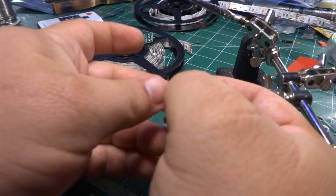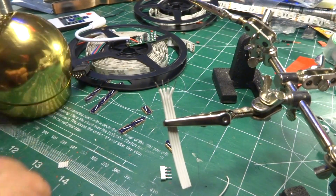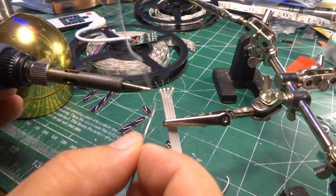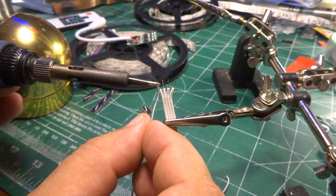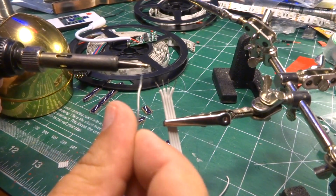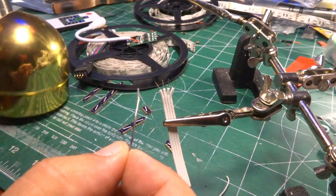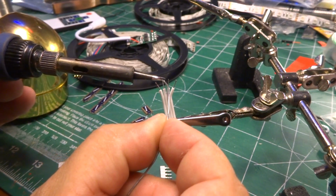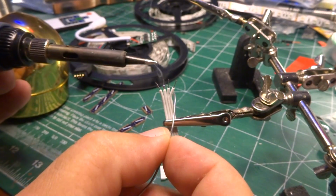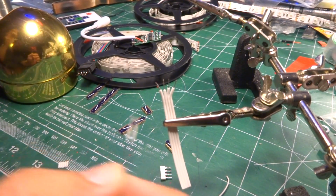So next stage is the tinning. And I cut them along because ribbon cable generally you have more than enough to waste, and you just add a little bit of solder to it, make sure everything's nice and clean, and you tap it on. And ideally it would be nice if you go ahead and put heat on one part of the wire and then use the wire to conduct the heat over to the solder itself. Adding a little bit of solder to the iron to start just is nice to get a little bit of flux on there and a little bit of heat to start the process, but then you want to use the wire itself to melt the solder in. That way you know the wire has gotten hot enough to melt the solder, the wire has gotten hot enough to bond to the solder.